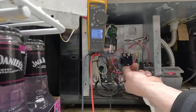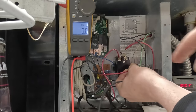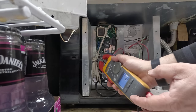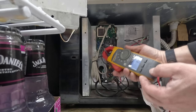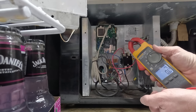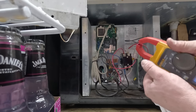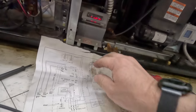That is what's causing it to freeze up, because it never shuts off. And that compressor's more powerful obviously than the heaters. Let's go down here and check amp draw and make sure these heaters are working. I am not picking up any amp draw on that — nothing on that. Let's go to the main power legs. Not getting nothing there either. So not only do we have a bad contactor, we have potentially bad heated coils — that's if it has elements. I don't know yet, but it sure looks like it's got them. Let's go over here and look at the schematic.